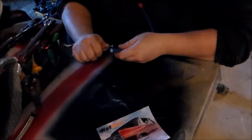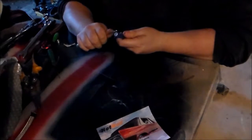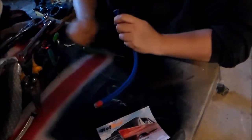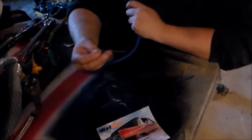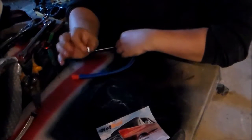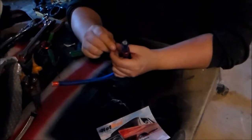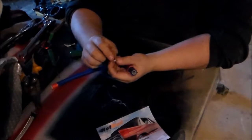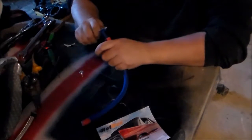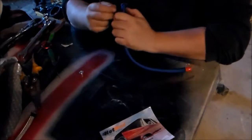Basically any way you can get that nylon off to where you have access to the stainless, because the stainless actually has to get pulled back too so you can put the ferrule in. This is a ferrule — it's beveled inward and that always goes downward into the nut. That way when you put it on it squishes and squeezes tight. These have a little stopper on the inside so it goes over the plastic hose. For now just keep pulling back all of this nylon.